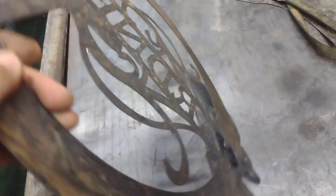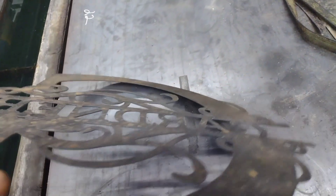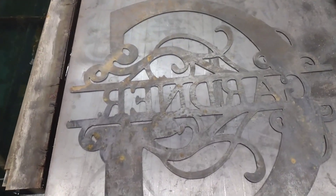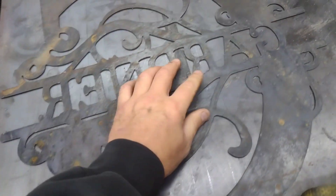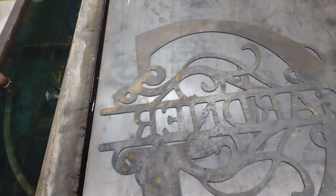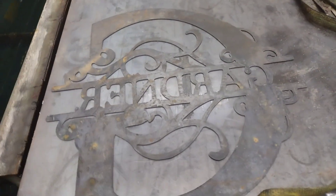This is an improvement from the Razor Cut that I was using before. I used to spend a ton of time knocking dross off with the wire cup wheel, so this is pretty minimal in my opinion. I think all this will knock off pretty fast — I won't have to use a chisel or anything, just the wire cup will get it.